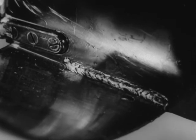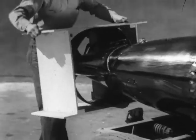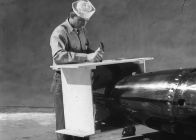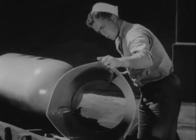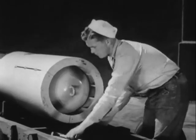This is a steel ring welded to guide vanes of the new torpedo. Using this ring tail with a nose drag ring and wooden stabilizer, successful test drops have been made at 2,000 feet with a speed of 350 knots. Optimum performance is obtained at about 800 feet and 260 knots. The stabilizer is secured to the ring tail with wooden dowels which shear on contact with the water.